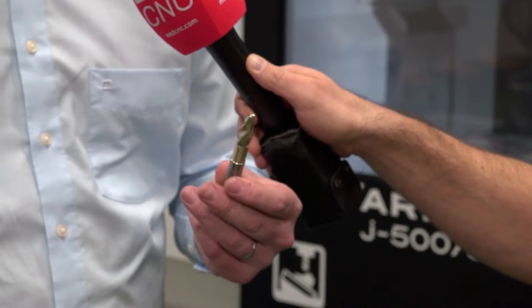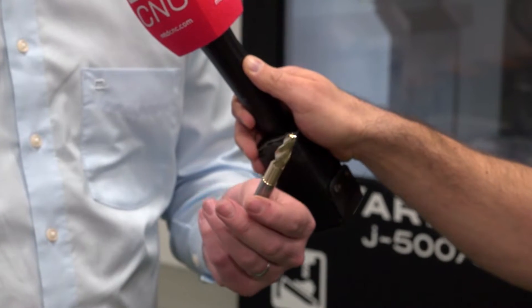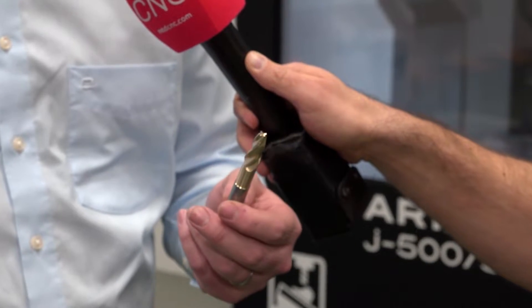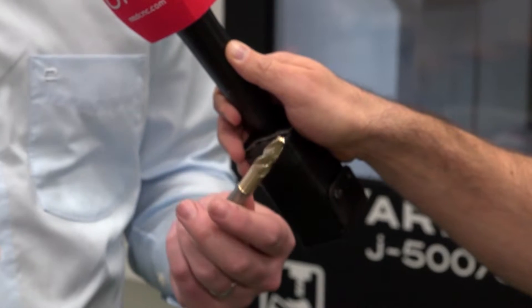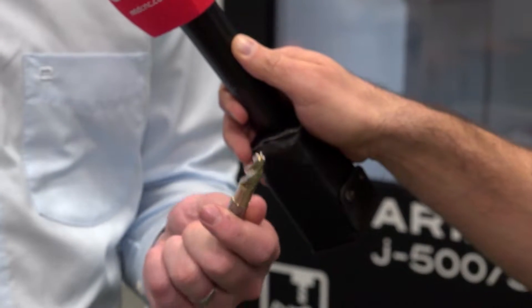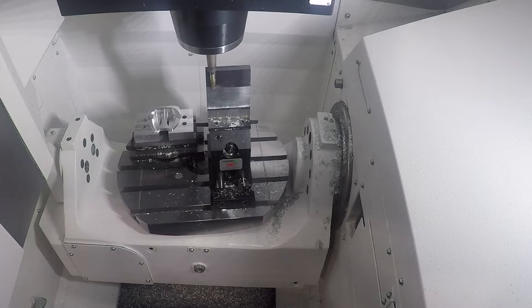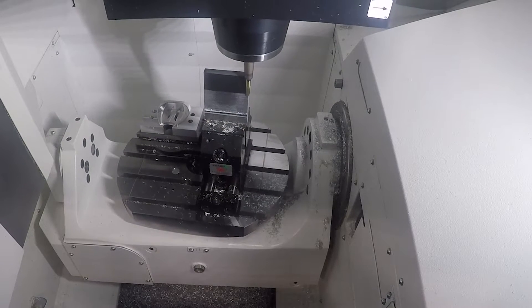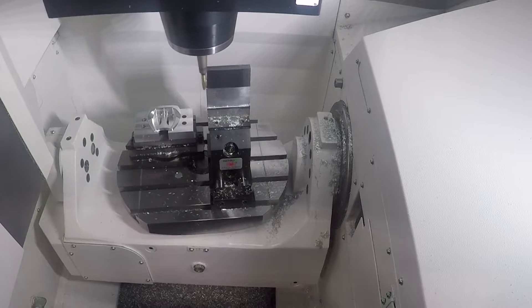The barrel cutter is used to replace a conventional ball nose tool. Whereas a conventional ball nose cutting tool may have a step over of 0.2 millimeters, this can utilize five axis machining technology to step over up to two and a half to three millimeters — so it's an 80 to 90 percent cycle time saving.